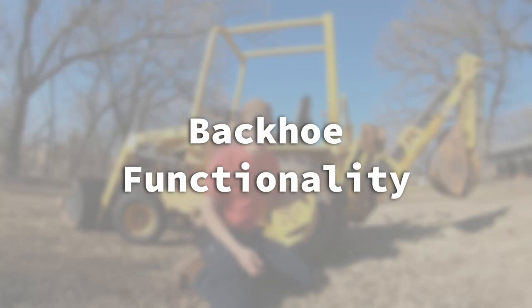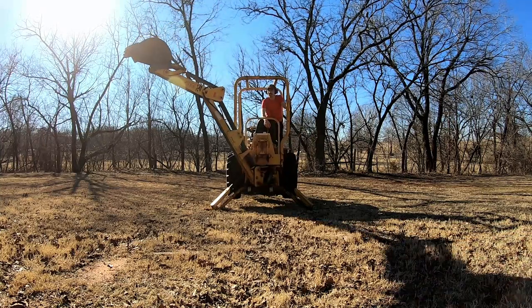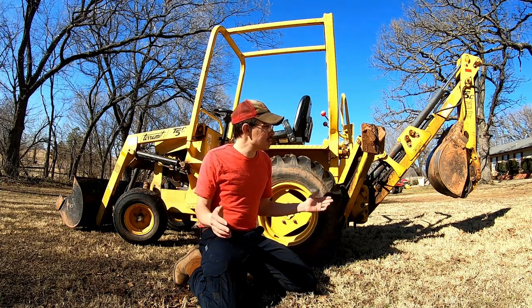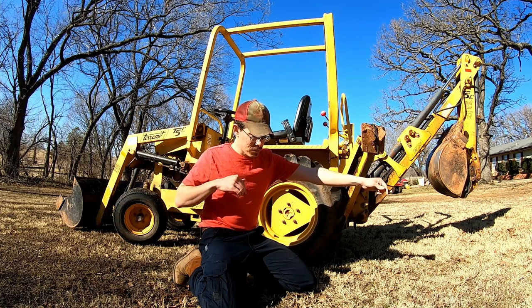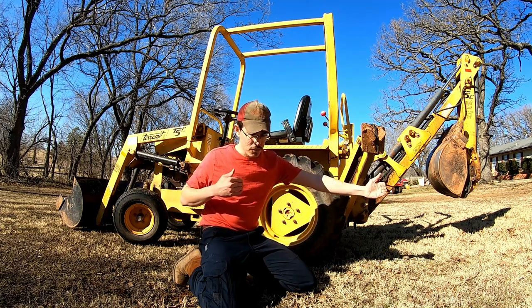because this backhoe only has, I'm trying to remember, I think it's 135 degree range of motion, so it doesn't have a full 180, maybe it's 145. It still does really well for the range of motion it does have, but when you're digging around a lot, you notice that if you're trenching, you can only make a level bottom in the trench, depending on the depth.